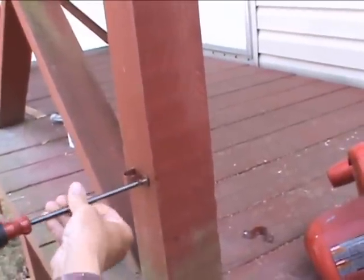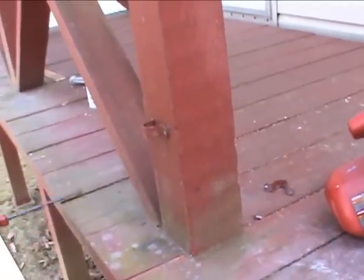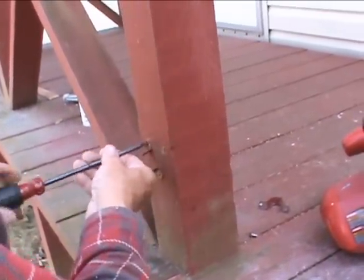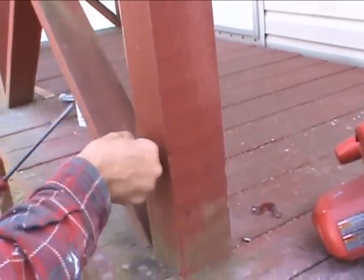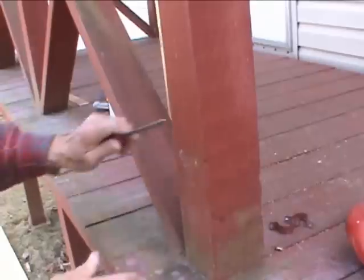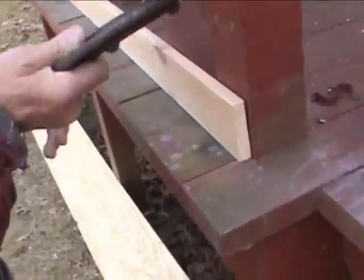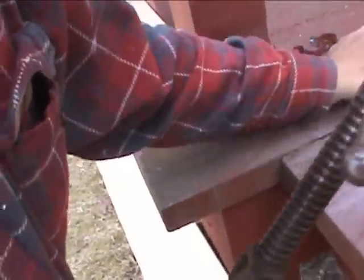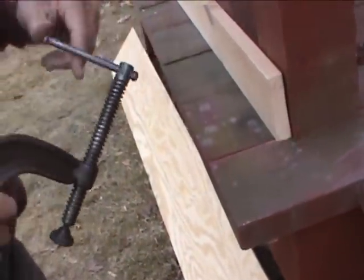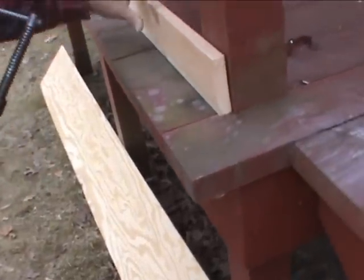And we got to put a board across here so that I can have it as a straight edge. So I'll cut this bottom overhang back a little bit. Okay. All right, what I'm doing here is I'm putting a straight edge here, and why I'm doing that, so I can cut straight with the skill saw. Now, I don't have an 8-foot piece of pine. I need 3/4-inch stock. A 2x4 was too thick.